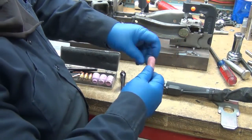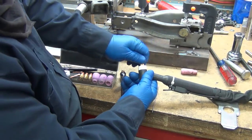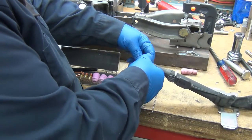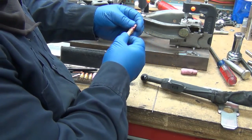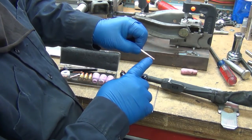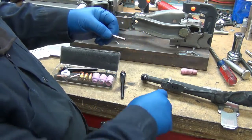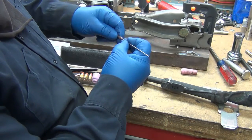I was using a really small cup here — a number five — because what I was doing at the time I needed a really narrow nose on it. Three thirty-seconds — wow, the heat has warped it. It's pinched in now, there's no more spring to it, which is why it's been so hard for me to get the tungsten in and out.